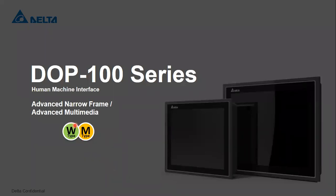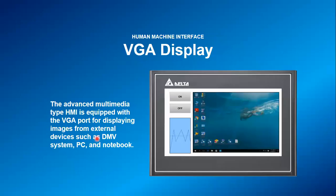And also we put the multimedia function into the DOP or DOP100 series. So let's see what multimedia means. So first one is a VGA display. Actually, we can use the HMI just like a normal display. We have a VGA input, so you can link this with no matter the PC, no matter what device, or actually, if you know the machine vision system, this is a very good function for a machine vision controller, because it needs a screen to show all the operation things. So this is one benefit for the HMI.